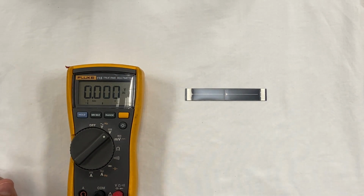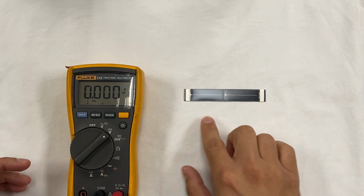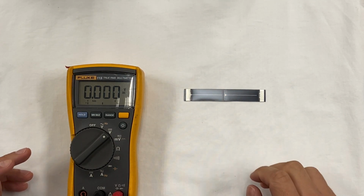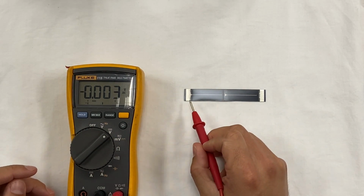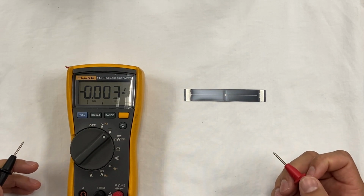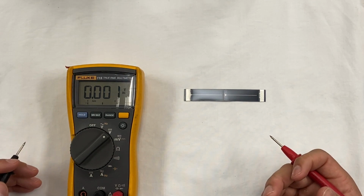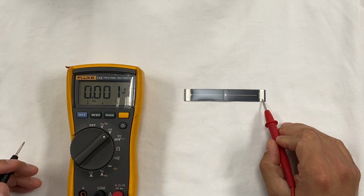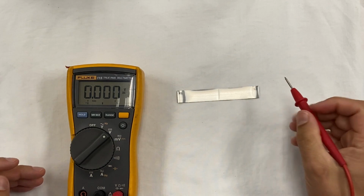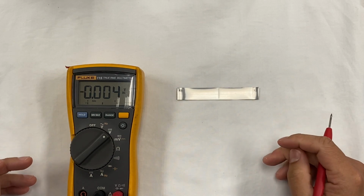Before we get started, a quick overview of the anatomy of our cells. Right here we have a two-cell design separated by insulator lines. So we have one cell, two cell, and the power terminals are actually on the sides of the panel. We use a tin-plated waffle foil bus tape, which provides some really great mechanical stability for things such as soldering directly through the laminate to the bus tape. For this specific module, we also use laser ablation to expose contacts on the backside if you want to use a conductive epoxy, or if you want to solder wires to the backside.